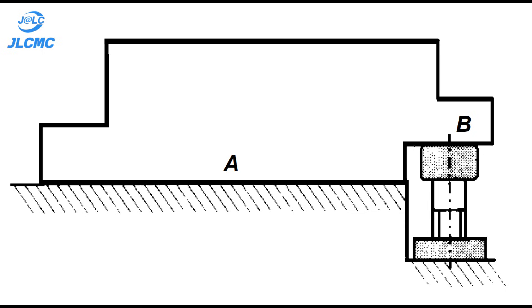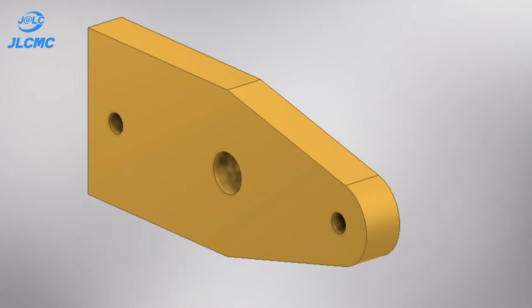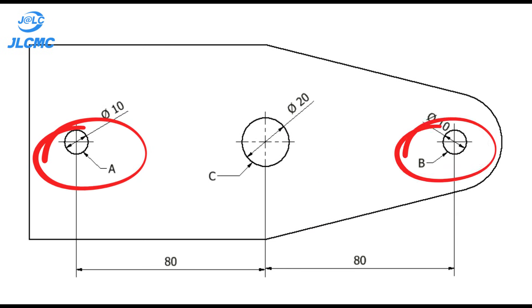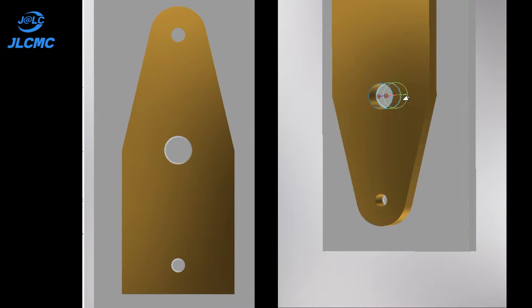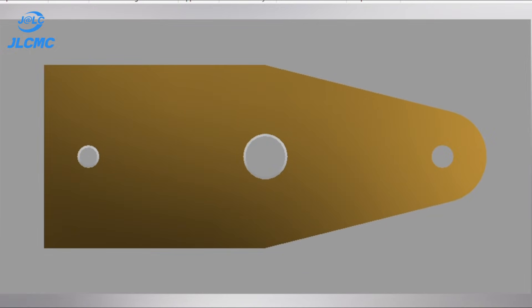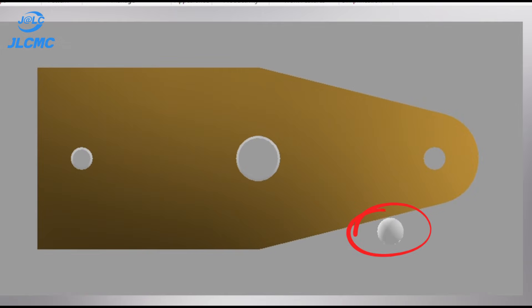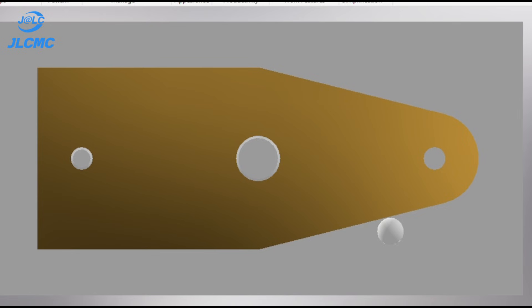Adjustable support is your friend here — the redundant locator at B should be replaced by adjustable support. Foolproofing is another important aspect of workpiece location, especially for parts with symmetrical features or multiple orientations. For example, if the workpiece is to be located from holes A and C, and holes B and C are equidistant from hole A with similar diameters, there is a risk of the workpiece being loaded incorrectly. The fixture design must prevent this using asymmetrical locators, blocking pins, or visual aids. In this example, a blocking pin is used. By implementing foolproofing techniques, machining errors due to incorrect workpiece loading are significantly reduced.